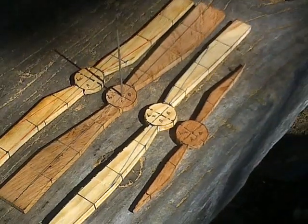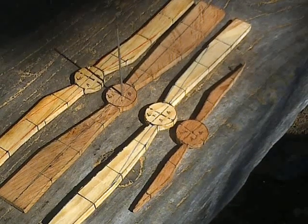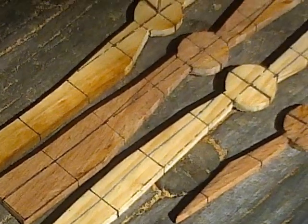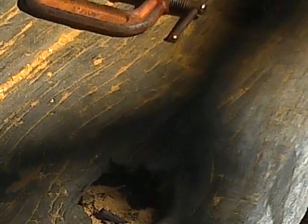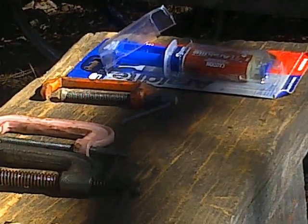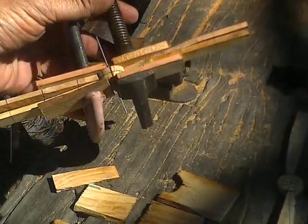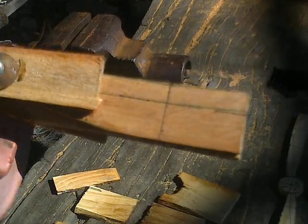Here's the next step in the propeller making process. After adding an extra half an hour to draw in the glue lines on both the top and bottom sides of the laminae, it's now time to start gluing them together. I have the four smallest clamps, some araldite, packing blocks, and there's another five minutes or so in setting up a dry run to make sure everything lines up before mixing the glue for the first lamination.